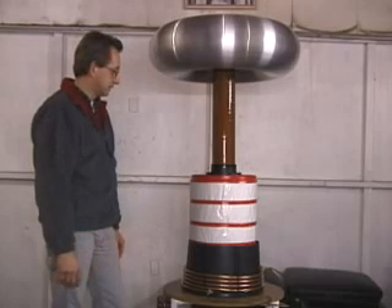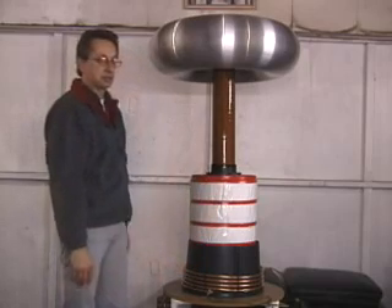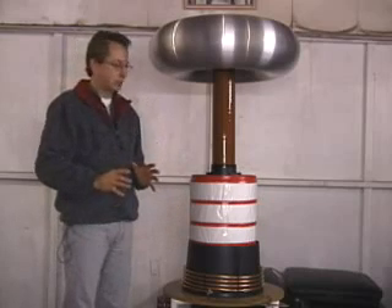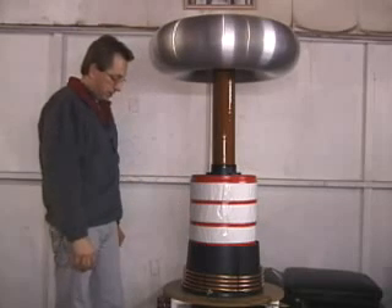So that's basically how it went. I was actually able to get this coil at 181 kHz, the primary at the same, and the extra coil at the same — as long as everything is in its position. If I were to move anything, it would change the resonant frequencies of everything. But I'm going to go ahead and run it.